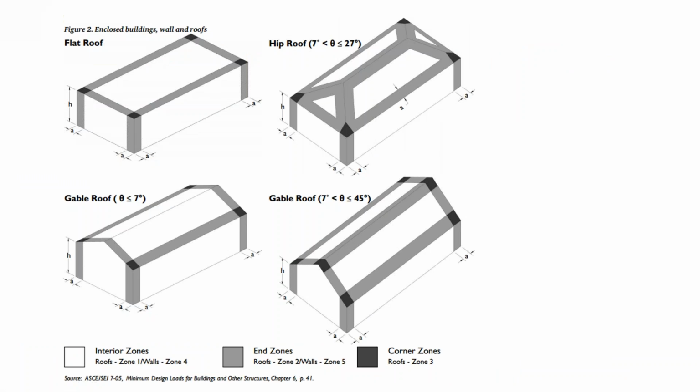And then there's also reasons not to go all the way to the edge. In our racking, we saw zone 1, zone 2, and zone 3. And essentially zone 3 is corners of the building, whereas zone 1 would be in the interior of the building. And so it's not a bad idea not to go all the way to the edge. For one, staying 3 feet off the sides is going to keep you compliant for most zoning restrictions. Sometimes in New York or on flat roof row homes, it might be a 4 foot offset. And if you have the space for a 4 foot offset, I would do it because it just means your working space up on the rooftop is much more accessible.